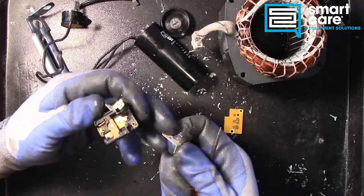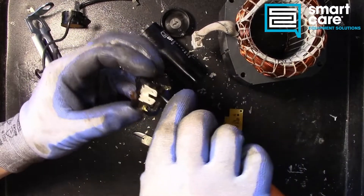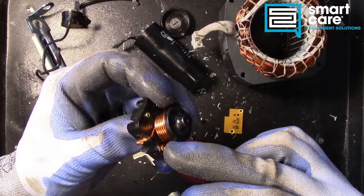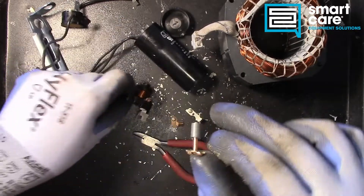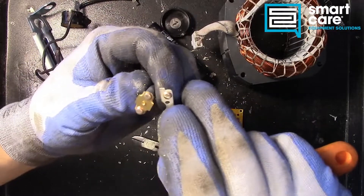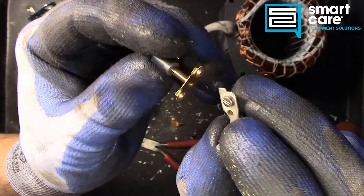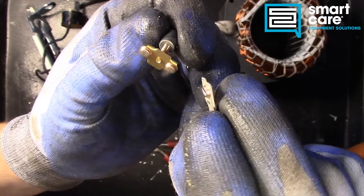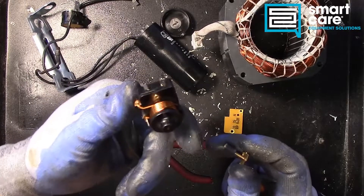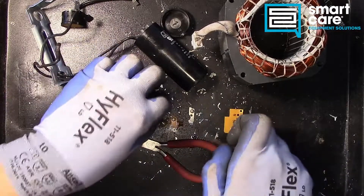With the cover off you can see inside here we've got a really simple relay. The first couple parts we're pulling out are the contact pads — you can see the little shiny contact pads — and then inside here we've got the plunger assembly. You can see the core of the plunger, and then the winding around the outside — that enamel coated wire creates the magnetic field that would pull that plunger. It's spring loaded so it has a little give when it's engaging. You can tell this one is new because there's no arcing or damage to the pads. The little pads would start to arc, they'd get carbon on them over time, and eventually they would fail. This is one of the failure points of a relay. The coil around the outside moves the little plunger and causes the contacts to close.